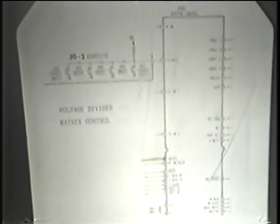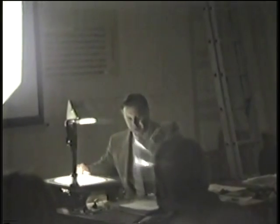And of course, with beta hi-fi recordings, you erase your audio as well as your video at the same time, since they're multiplexed together. The only thing you can alter on the 900 is the linear audio. And it goes on to give you a little chart as to the different ways you can handle that. Page 30. This was mentioned in the tape.